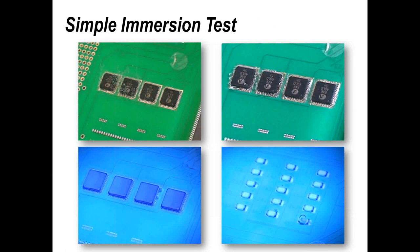Going back to what Keith mentioned — the reaction of conformal coating with packages — Dave Hillman's work on potential failure modes when you look at BGAs and conformal coating is not new. I can remember Keith and myself working on a Dage machine at a show in the US when a customer came to examine T-SOP joints where all the solder joints had failed — the factor was a conformal coating choice the company had made. There is currently concern and at least one technical paper about failure modes of QFN/LGA with conformal coating and the potential for issues.